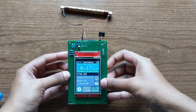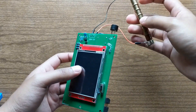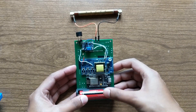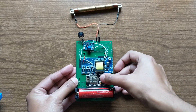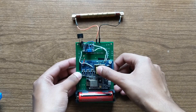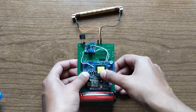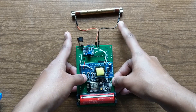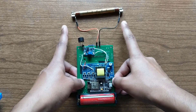Here's what it looks like on the inside. There's the Geiger tube sticking out, and then everything else is on this PCB that I custom designed. Looking at the back, it's powered by this 18650 lithium-ion cell. I'm using the ESP8266 board as my microcontroller, and then this module here is the high voltage power supply — it's a DC to DC boost converter that works at really high voltages. I'm currently supplying about 430 volts to the Geiger tube, and 400 volts is about the recommended voltage for most Geiger tubes like this.